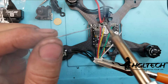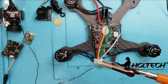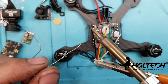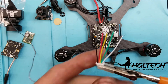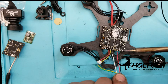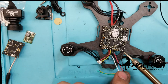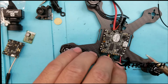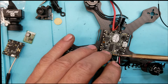This is the plug for the RX — the radio receiver. And I hate the plastic wire that FrSky has used on this. The plastic wire is just cheap. The problem is as you solder it the plastic starts to melt, and not only that, the wire is just super brittle. Even vibrations — not just crashes — can cause the wire to just break right off. Very brittle and just horrible stuff.